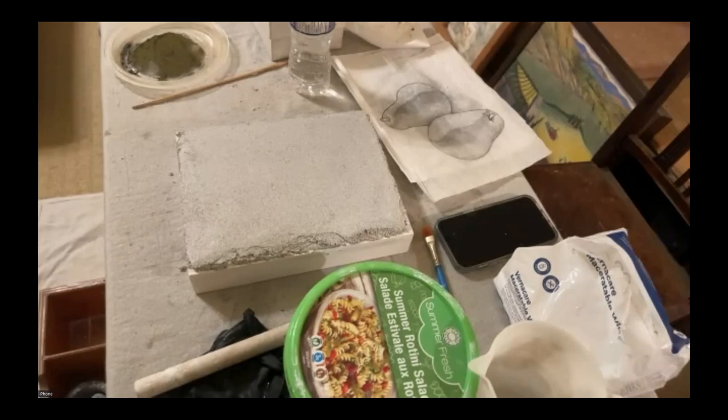It's 12-year-old lime. So the plaster is something that I make with a mixture of lime and masonry sand. Masonry sand, you know, you can get at any construction place or places that sell soil and rocks and gravel and stuff like that. You just want to get masonry sand that goes in concrete.